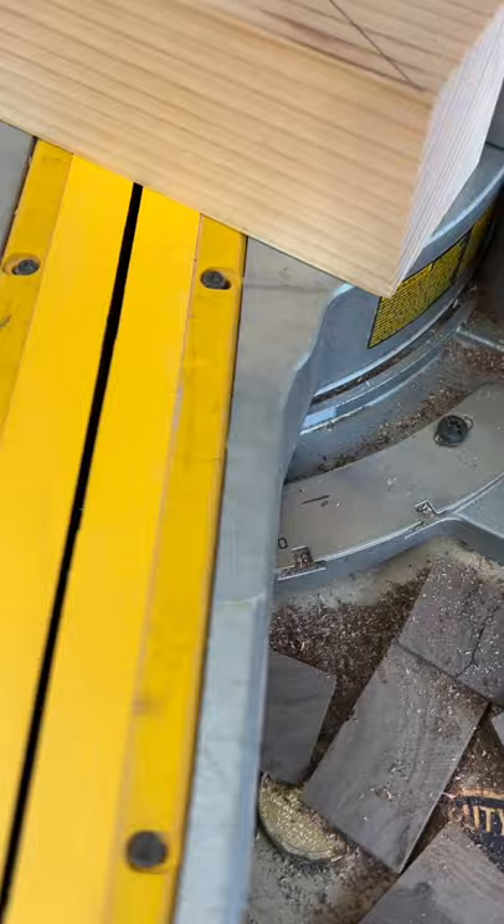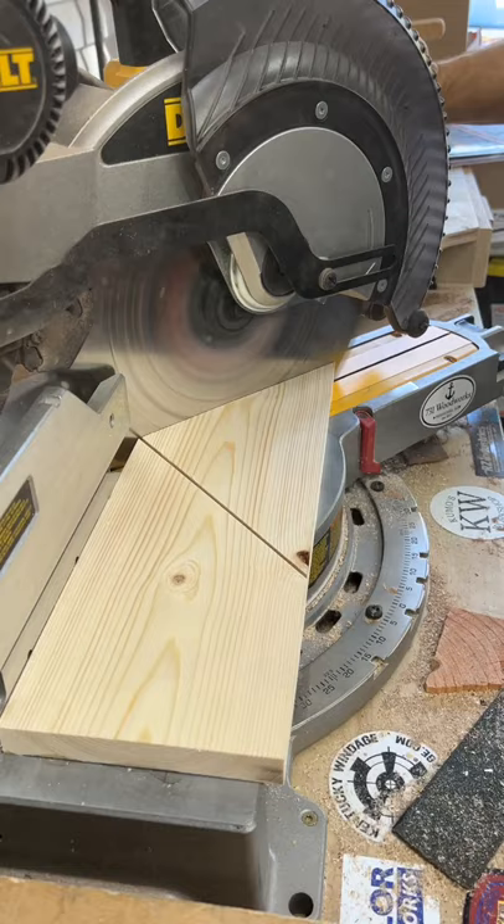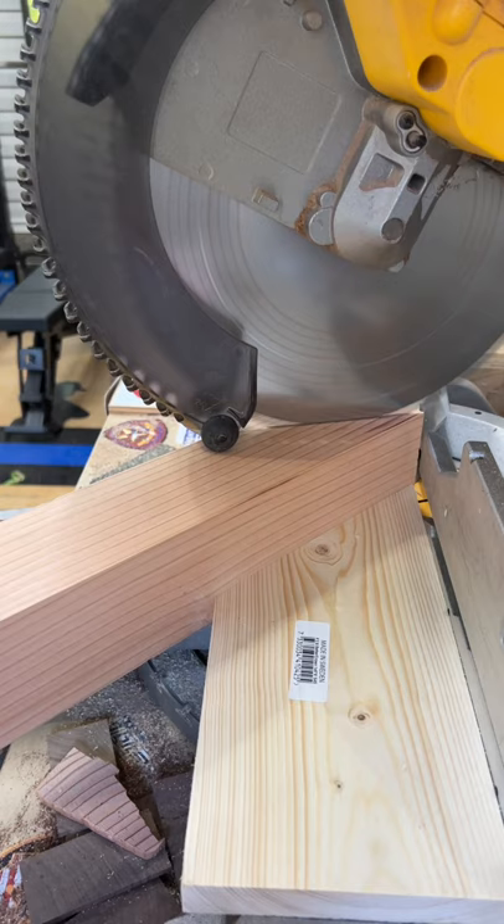Take a little CA glue — don't worry, this comes up later. Put a little activator on the board and push this down. I'm using a one by six. Cut it 45 degrees one way, 45 degrees the other way, and then remove that piece. Now you're using the board as a temporary fence so you can cut those large angles at any angle you want.